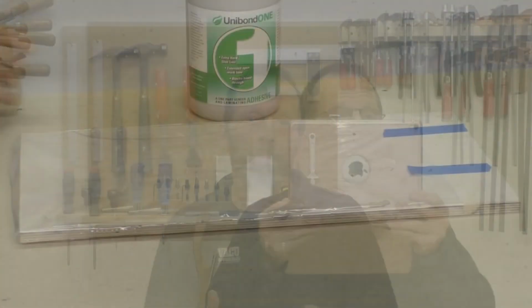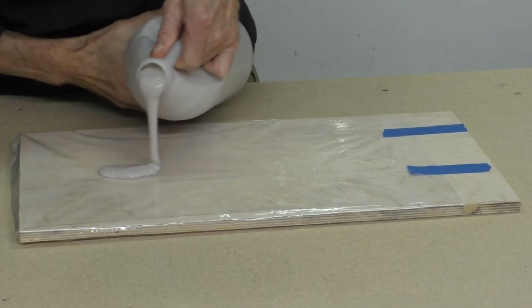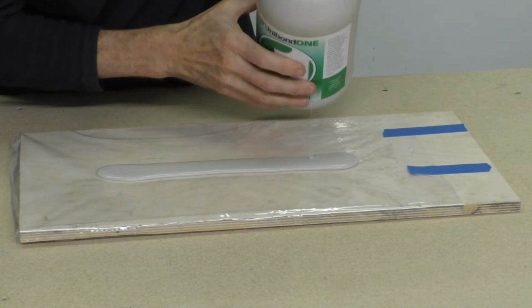If the glue's main purpose is to hold the veneer from moving at all, no expansion, no contraction, then the glue's primary quality should be rigidity, as hard as possible. With this in mind, let's consider the 5 glues I talked about earlier. To demonstrate this point, I have poured out a strip of these 5 glues on a sheet of plastic earlier and let them fully cure.